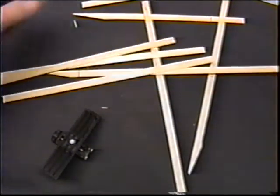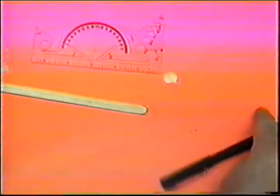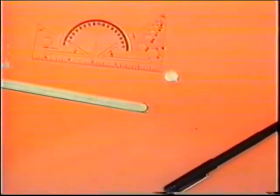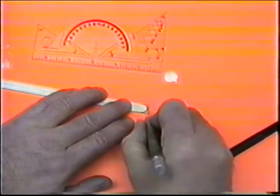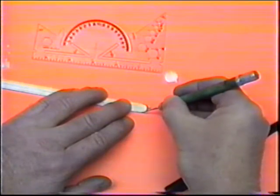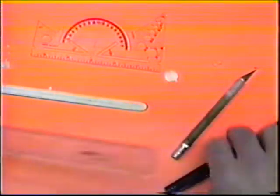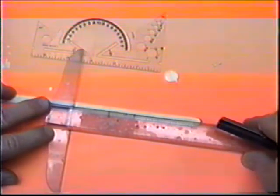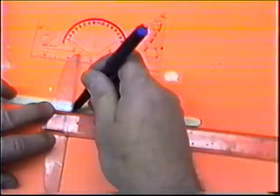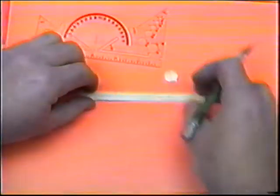We could lay out the ribs now. With a circle guide or whatever, I can make up a little template. This will be my template for all the ribs. I'll leave half of the line on. And now I need to measure 5 inches. This is going to be the longest of the ribs that I need. I'll make them a little bit oversized because I'm going to trim them just like an I-beam wing. With this in mind, all I need to do is take the strips of wood that I have over there and make up 23 more of them.